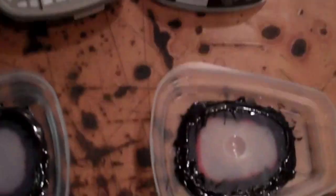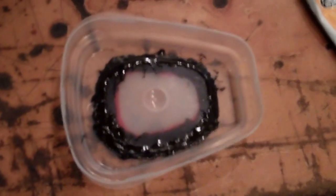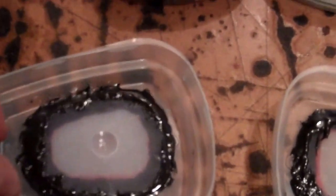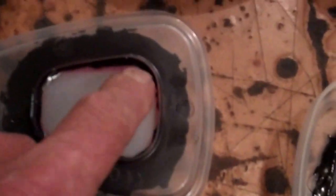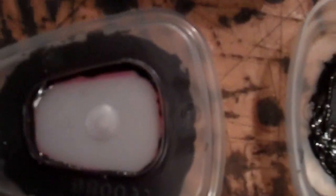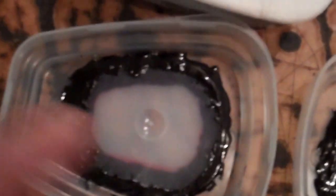This is part two of building a homemade full face fresh air respirator. I've epoxied these pieces because this was open here. This piece snaps onto that piece, and then there's another filter like this. Then this cover right here snaps over. These are covers off of fiberglass resin bottles and I cut out these pieces about a quarter inch bigger than the hole.